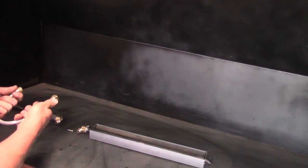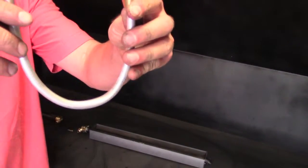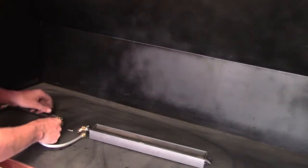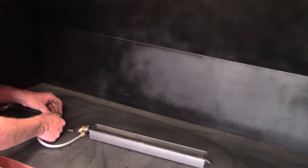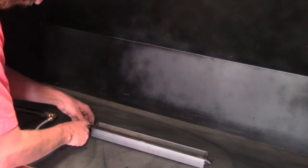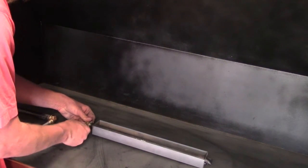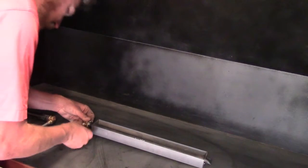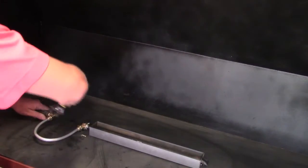The length of each side of the U-shaped tube can vary in length depending on your preference of how far forward or back in your firebox you would like to situate the flame. Do not use any plumber's putty, tape, or pipe dope on these brass connections, as the flared fittings are designed to provide a tight seal. Tighten up the fittings with a wrench to ensure a secure, tight seal.